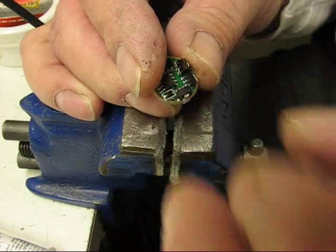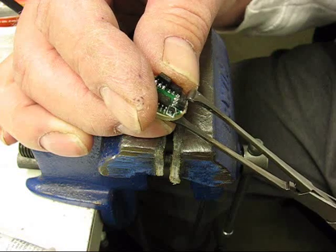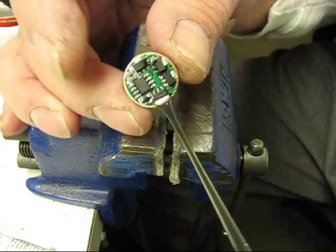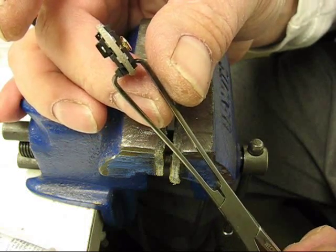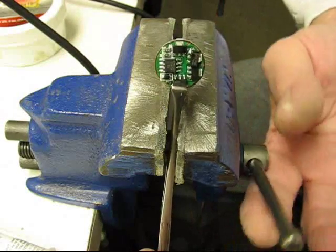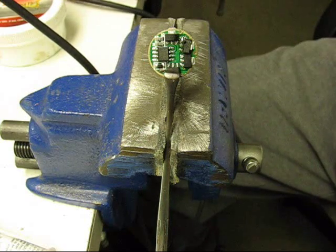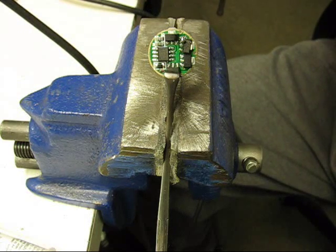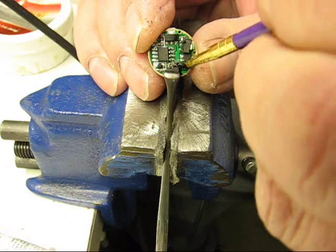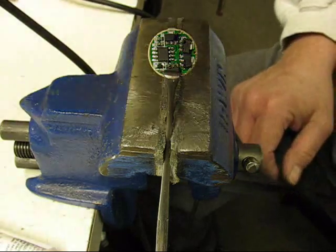I just always have so much fun with these things. Now I've got that chip in place and I'm going to take these hemostats — I may have to move it out of camera range — and clamp that chip in place. You can see there how that is set up. I clamp that chip right into place and hold it tight and then I can put it in my vise. I have the little brush now and I'm going to put some flux down on this board, loading that flux on there. I'm not worried about putting a tiny amount — I want some flux on there so I'm going to load it right on there.